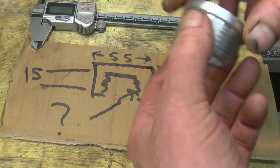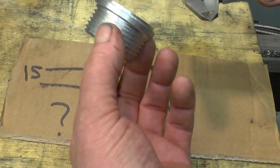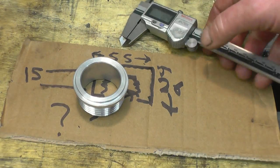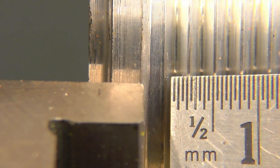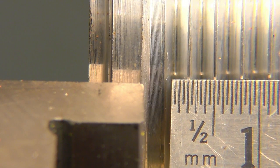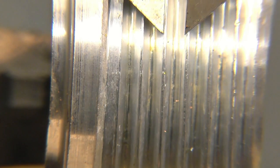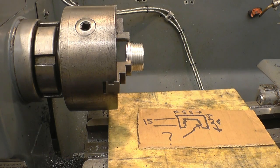Basically he wants a screw-on cap on the outside — it's got to be knurled. I'm going to try and find out what thread this is. I've put it in the chuck so I can hold it easier, and we'll try and measure the thread. I've zoomed in close with my macro lens and it appears to be — going crest to crest — a 3mm pitch. The vernier says 3mm as well. So it's a 3mm pitch — I can cut that no problem.